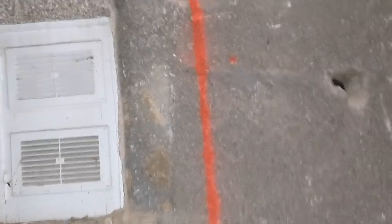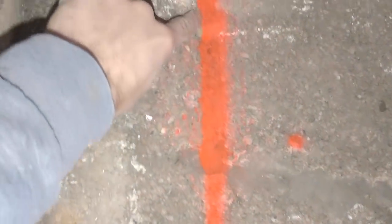And what I've done is I have spray painted on the wall. On the left-hand side of this is where I've got to stick to, basically. Obviously, I've done that straight off this padstone. This is the depth of the wall inside the room. I obviously don't want to be halfway down the padstone, given that this is supporting all the weight above it. So I'm going to give the padstone the full brick. So I'll be chopping on this side of the line all the way down.